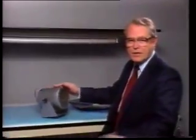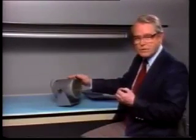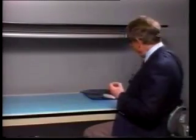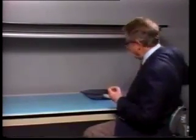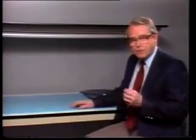If you want to hurry the process along, an ionizer generates both positive and negative ions, and as they flow around the object, it takes what it needs. But even an ionizer can't neutralize the charge quickly enough to prevent damage, which happens in the first few millionths of a second. So what can we do? Well, the basic rules are simple.